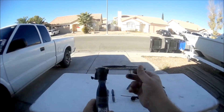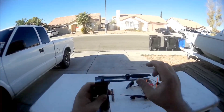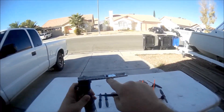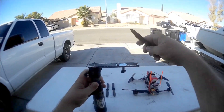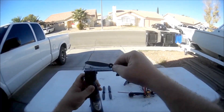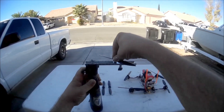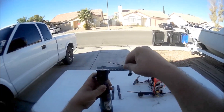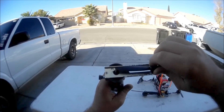I got this circle cutter in one of my Dremel sets for cutting a circle in drywall. All you have to do is place a spacer adapter on there — it'll fit. Take the smallest adapter and drill it out to where it fits tightly over top of the point, like that. Adjust it for the size that you want, and as you can see it's going to cut it off right there.